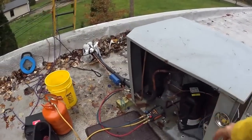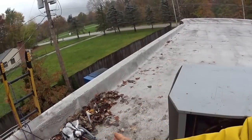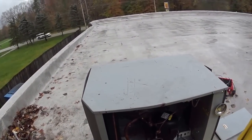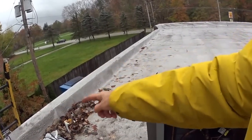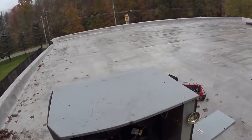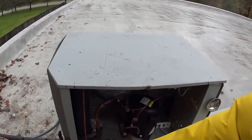She kicked right in again. Refrigerant is coming back. The solenoid valve downstairs just shuts the liquid line off, so no refrigerant gets past that point. The compressor keeps sucking all the gas out of the evaporator coils and back into the compressor. When I opened it up again, the solenoid valve opened and let liquid refrigerant run through all the evaporator coils. The pressure rose up and it kicked on — fundamental refrigeration. It's working.